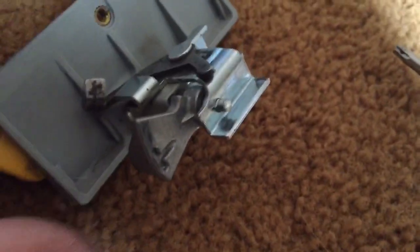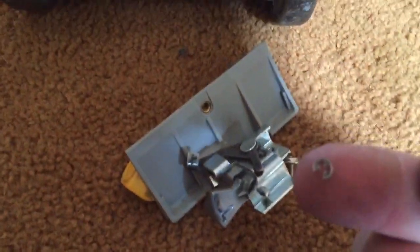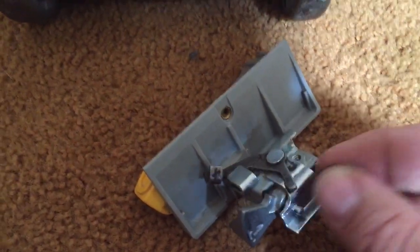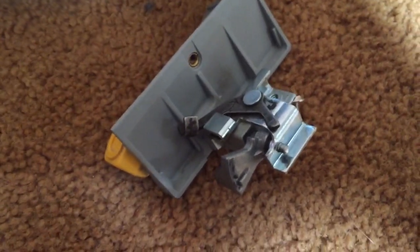What I did was I took my little saw and made a little groove right there, because this has happened to me twice now and I'm getting pretty tired of it. Then I'm going to use this little C clip and clip that on there so that the shaft doesn't walk out again. Then I'll show you how it goes back together after I get that clip on.